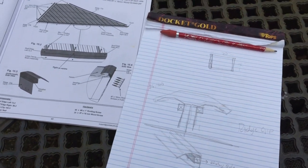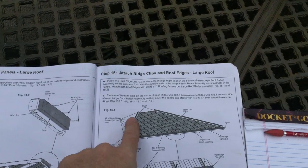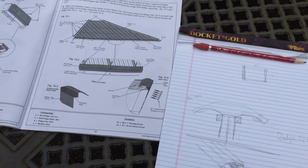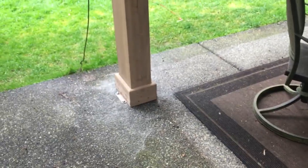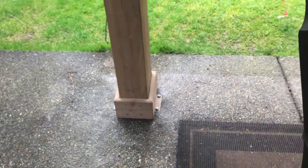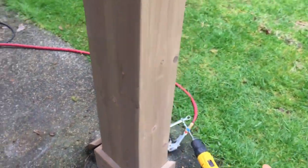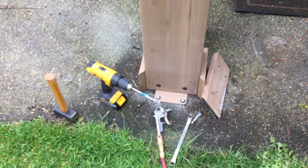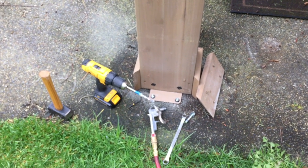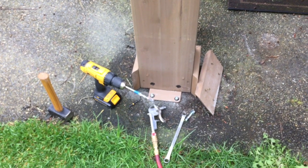That weather stripping sits on the corrugated metal roof when you stick it to the side with five screws, which is what this part of the diagram shows. So this is just an afterthought — I really was just doing this to show you what it would look like when you put the anchors in, which there's more of a finished side there all the way around. But in hindsight, those ridge clips were kind of a pain and I should throw that in there too. Hopefully that helps you guys when you're putting your anchor points in. This has been pretty quick for me — probably about 20 minutes total. If you're going into solid concrete, you're probably going to want a hammer drill for sure. I was going into aggregate, a little easier to work with. Hopefully that helps. Have a good time with your project.